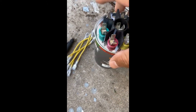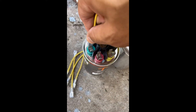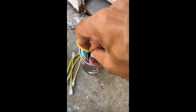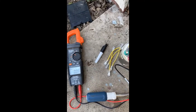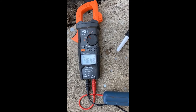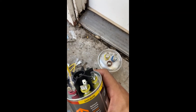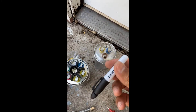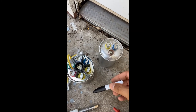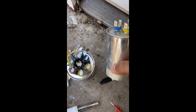For the 45 microfarad hermetic side, we do a little math: 20 plus 25 equals 45. In the universal capacitor box, they provide jumpers, so I would jumper out the 20 and the 25 taps. Checking with the meter, it reads close to 45. Don't forget to write down the values you're using — in this case 45/5 — so next time you can get the actual replacement capacitor.